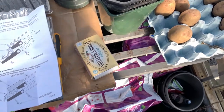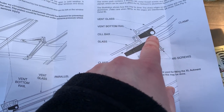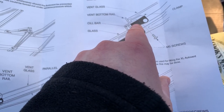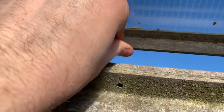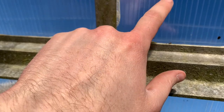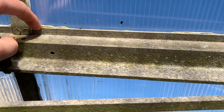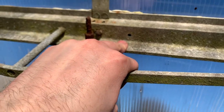Looking at the instructions for the metal greenhouse, you've got the long leg on the lower part and the short leg on the top part, and you normally have this little kick-out with the glass going on top. I haven't got that kick-out - mine is literally flat glass stuck in with a ridge underneath. I'm trying to see if I can clamp onto here, and then I might just glue the other end to the panel with silicone. Hopefully that'll work and it'll open and close fine. If not, I might have to take this panel off slightly and clamp it onto that section there, then put the glass back.